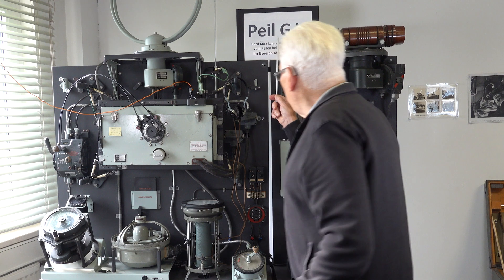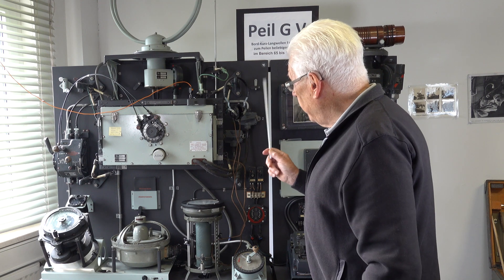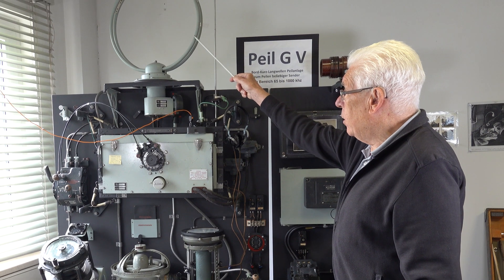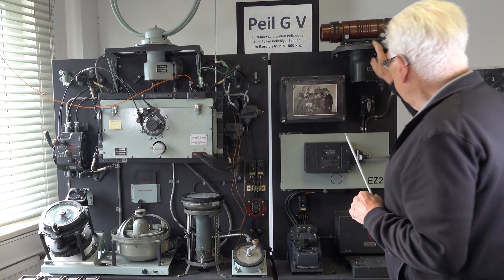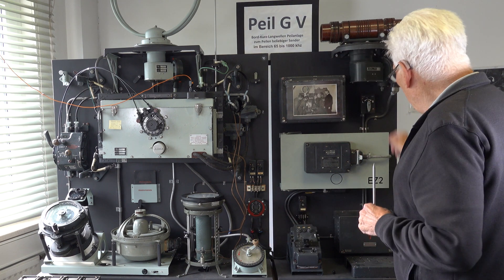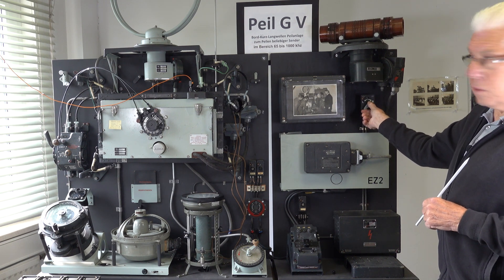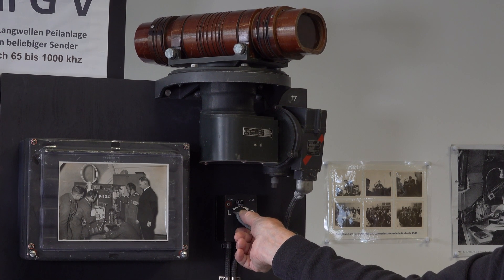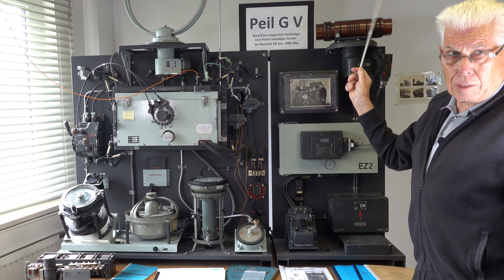This is the system G5, a very old system, and later this was a big problem. Dieter points out that in the older system the loop antenna, as well as causing drag, could be something of a combat liability, with the plane's gunner accidentally shooting across the aerial and destroying it. Later models featured a low profile beam antenna controlled by an electric servo motor. The new DF antenna had an iron ferrite core and was more sensitive than the older air loop design — the older one had air inside, but this one has iron inside.